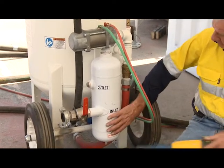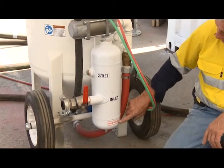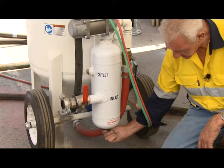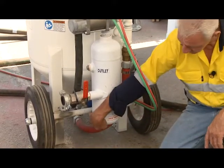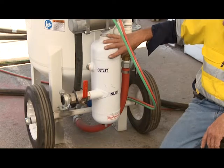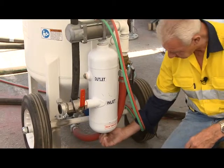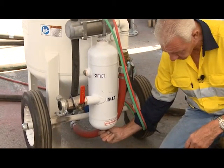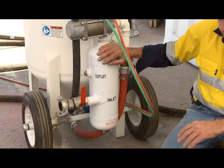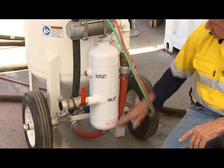On the bottom of this moisture separator bowl there's a notation: 'drain tank daily.' Basically, that's a little quarter-inch tap and you'll have that tap slightly cracked open all day. You don't want to leave it closed with no moisture escaping during the course of the day. You'll crack that valve open during operation so it's just weeping off a small amount of air, which enables it to dispense with any excessive moisture that may occur during operation of the pot.